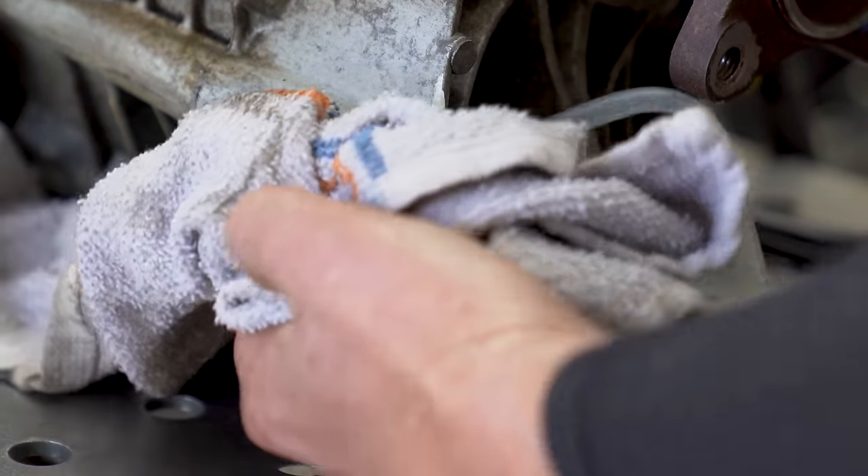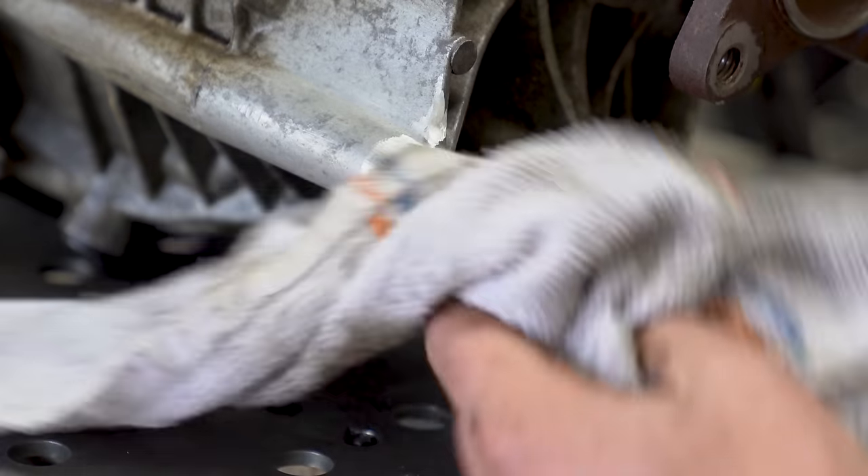As soon as you get down to bright metal, skim the layer off the top, hit it with some acetone, let that dry, and then I'm going to blast it with the torch.